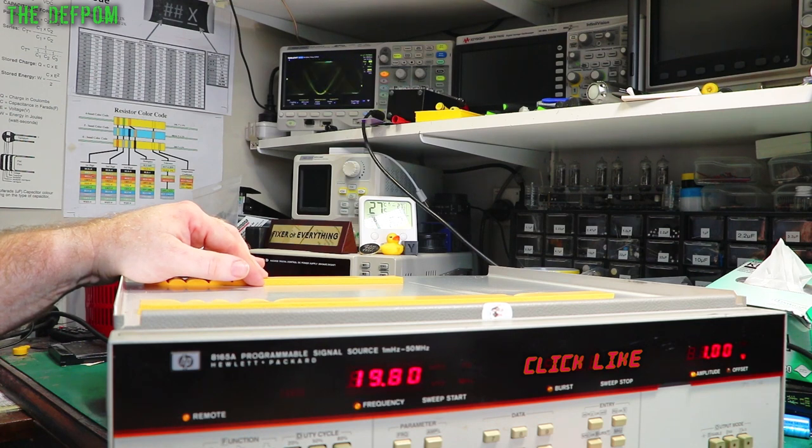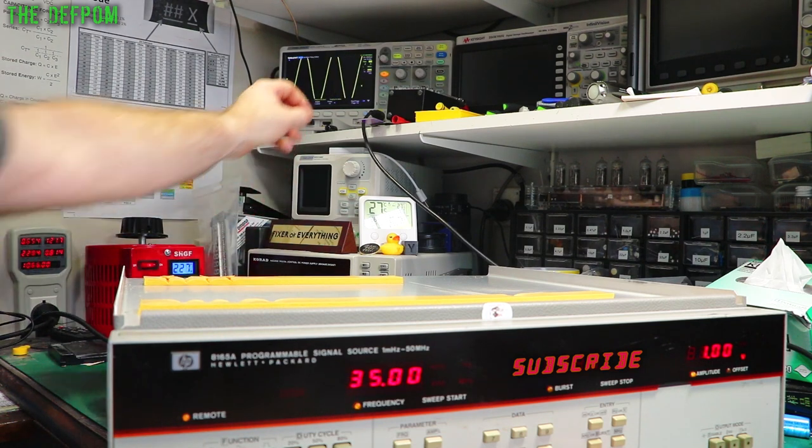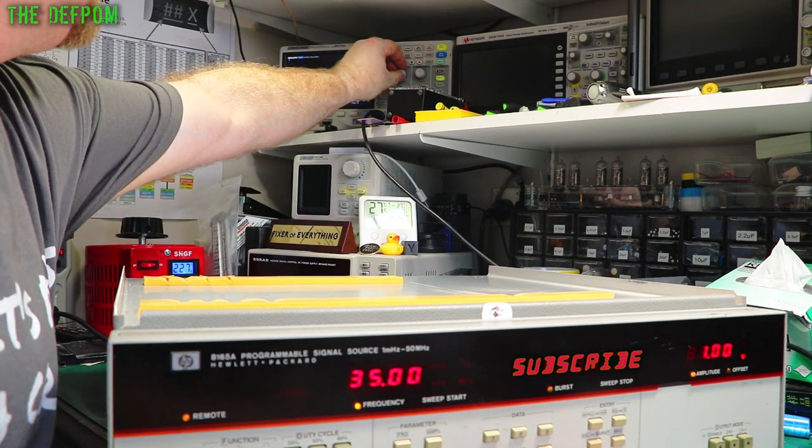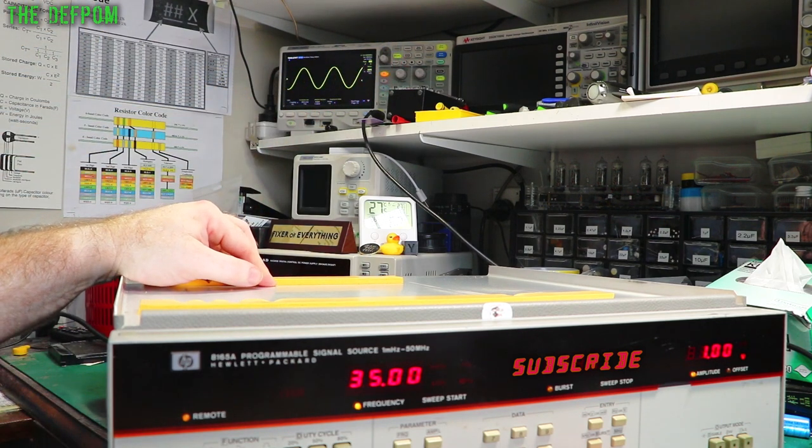Where does it start increasing? About there is where it bottoms out. So it's about 12 megahertz is staying there, but after that it starts to increase. It's about 1.22 volts now. It's 1.5 volts there, 27 megahertz. So that's interesting where it's increasing. An amplitude, that's not probably supposed to do that, it might be a calibration thing.